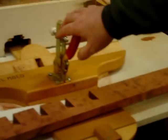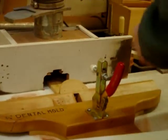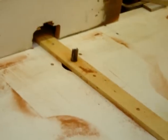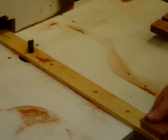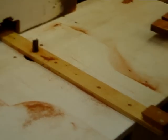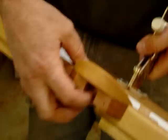I've devised this jig that helps me do that. There are a couple of key components to the jig. One is just a simple router bit — a three-quarter inch straight bit that comes through the jig. This here is a rail that everything runs on and it simply just screws to the router table. This part here is the slide; it has a channel that receives the rail and then the bit comes in through here.